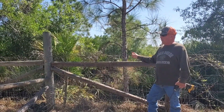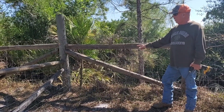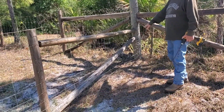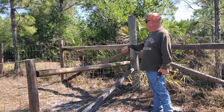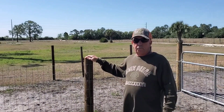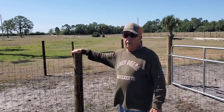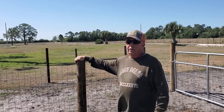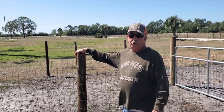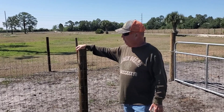If you've got long runs, like cattle fencing hundreds of feet long, you're going to want to put in this little 45-degree angle beam here — this helps with the pressure when you pull on your fence and adds one more piece of stability. On 300-foot runs, these help you keep a nice, tight corner. Now, the posts I recommend here are three and a half to four inches by six feet long — that's what I'd recommend using. You'll save a little money if you go smaller, but it won't be as solid. These run about $8. We get these at Lowe's, but you can get them at Tractor Supply or Rural King. Three and a half to four inches by six feet long is what we use for our intermediate posts.